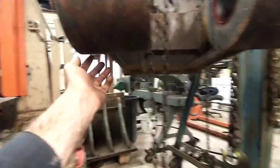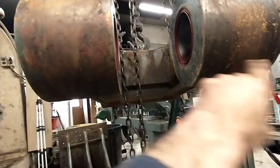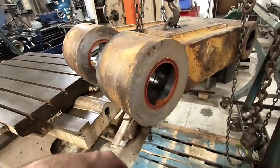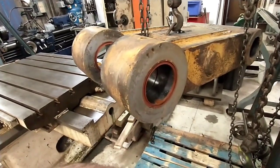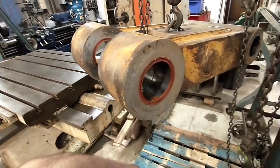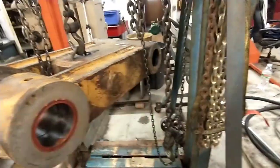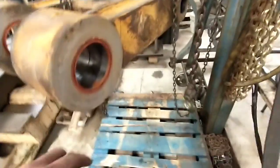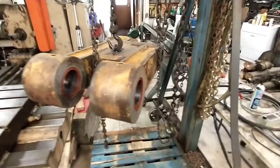I've got to do a little bit of head scratching. I think what I might do is check for burrs on the bottom edge here, and then try just setting it right on the table and run an indicator through these bores. The bore on that end is the one I'm fixing, so we're leaving this end alone. I'm going to run an indicator back and forth through these bores, and if they're showing parallel with the table, I'll put a single block under the end of that — basically a three-point setup with stop blocks behind it so it doesn't slide.